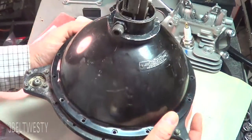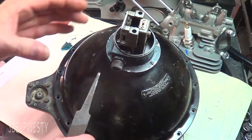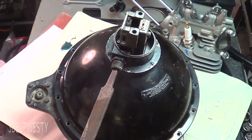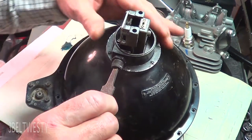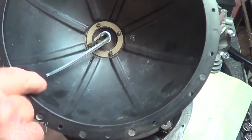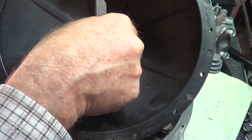And on here is a gizmo that is used to move the gyroscope to be caged and uncaged. It's got an interesting mechanism. I've got the top off of this, but it has a worm drive that you turn, and what it does is it takes this arm, and this arm will spin around, clockwise or counterclockwise, and as it does, it comes out of the bowl.